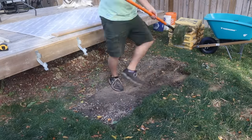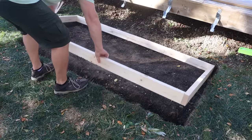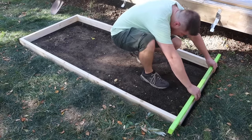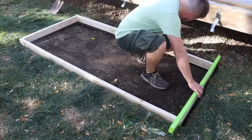All total I ended up digging down and scraping out about two inches worth of material, then I dug a trough around the entire outside. This just allows the form to kind of sit down and get a little bit lower in relation to the ground where I wanted it to be. It also gives you some wiggle room to lift up and push down in certain areas to make sure you can get the form level.